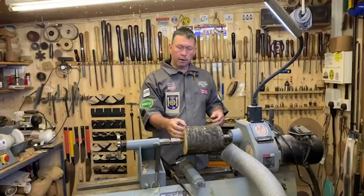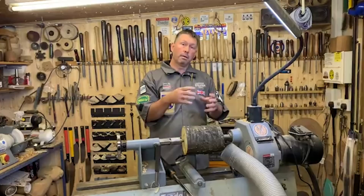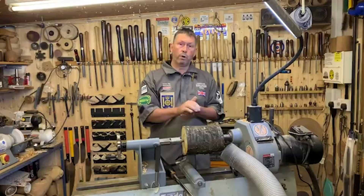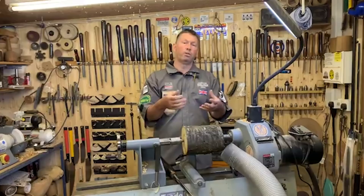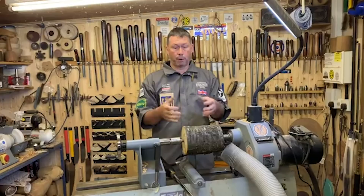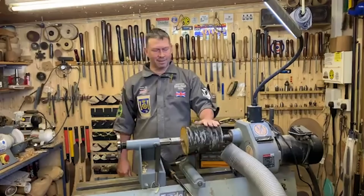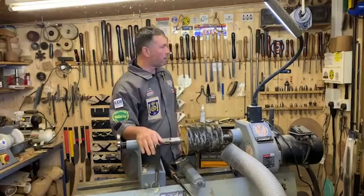The bark will probably come off - I'm not worried about that. I'm going to start by making a hold point, taking down some of this rough area, putting the chuck on, holding the piece in its final position, hollowing it out, following the contours on the outside, with a nice little base, then parting it off. We're not going to sand it while it's soaking wet - you sand them when they're dry, so hand sanding afterwards. Leave it on its foot to dry a little bit - be aware it will move like mad. This is more of a fun turning project than a finished piece.